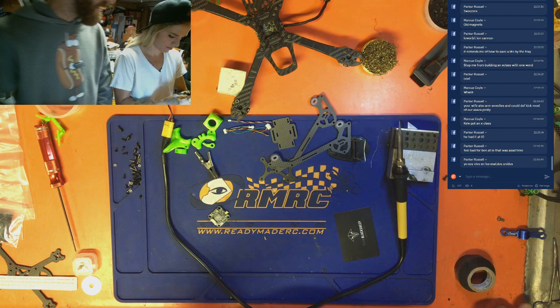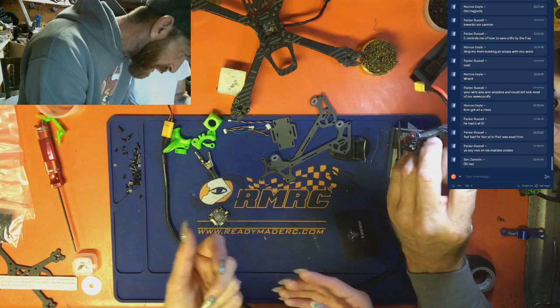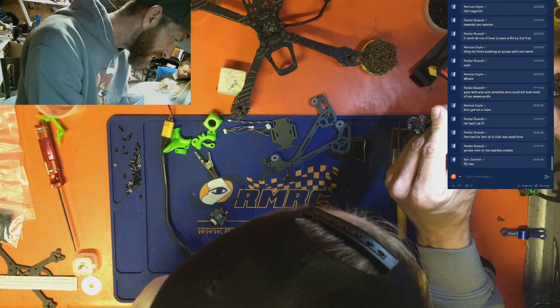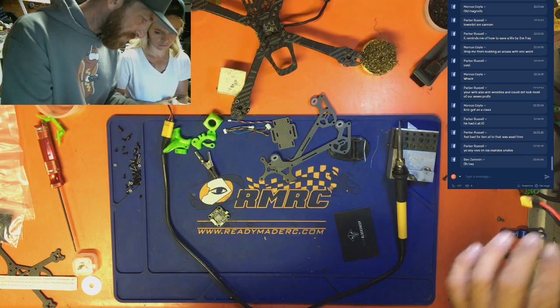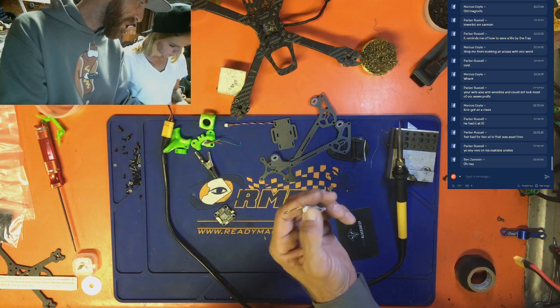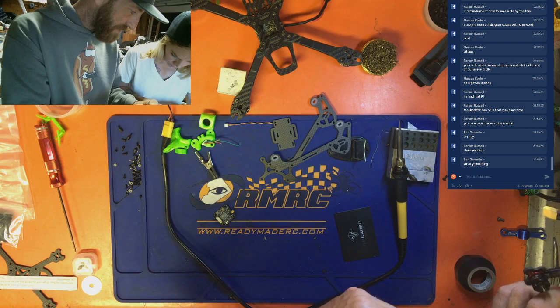Okay, so we're gonna have to pull it off. See right here it says there's a negative, a cam, and a 5V. And then a negative, a VTX, and a bat. Bat is battery powered, so it's getting as much power as you're plugging into the lead. VTX is your output wire to your VTX. It's going to be the yellow wire that goes to this. So in this harness you'll have black, red, and yellow, right? And in the VTX, you have negative, black, yellow is VTX, and red is bat.